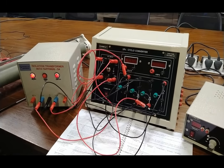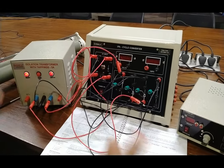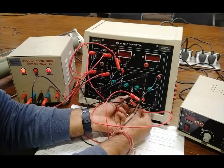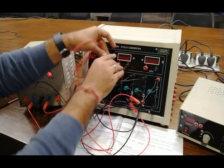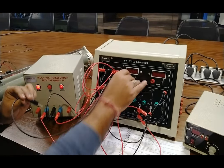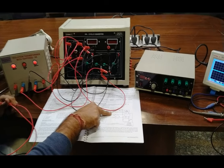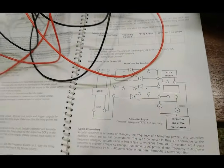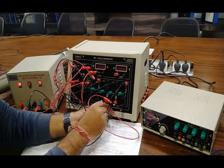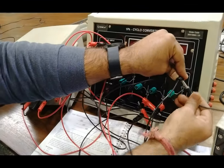For adding the voltmeter to the circuit, we connect the anode of T3 to one terminal of the voltmeter, and the other terminal of the voltmeter goes to the center-tap of the center-tap transformer. We then short-circuit the anode of T3 and T4 together to complete the bridge, connecting anode of T3 with anode of T4.